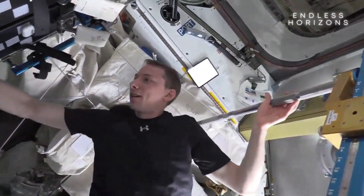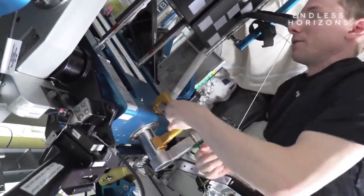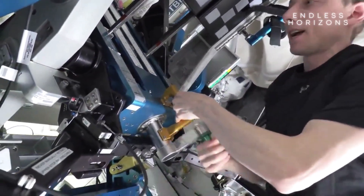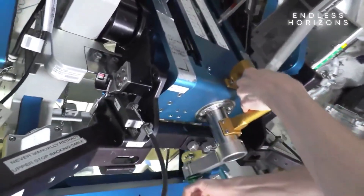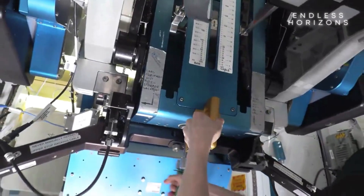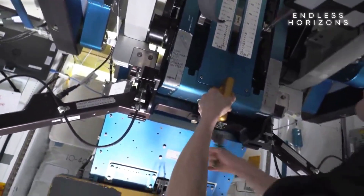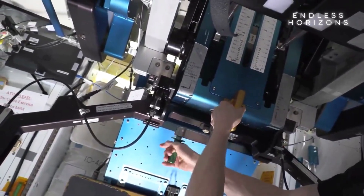By changing the location of these arms relative to this pivot point, which I do through this crank, I can dial in different weights and change the distance at which those vacuum cylinders pull — change their lever arm. And so through that, we're able to vary the resistance that we feel on the bar.